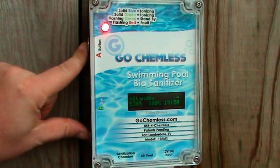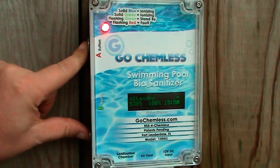While the controller unit is engaging New Pool Wizard, you will see some information flashed on the status display LCD, like locked, reset, AG on. AG means silver, and then New Pool Wizard. When you see New Pool Wizard displayed, release both buttons.